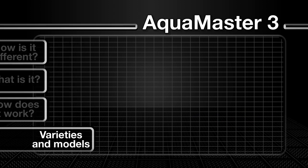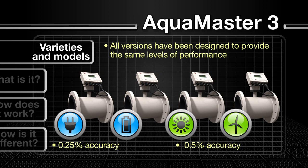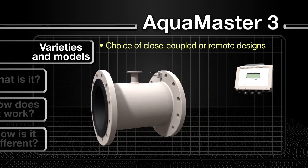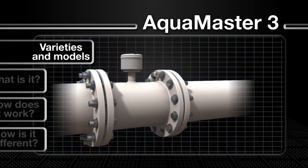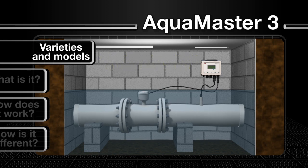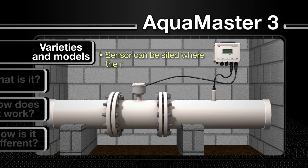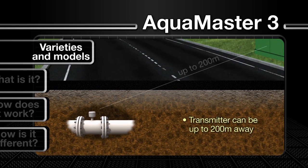The mains, battery, and renewable energy versions of the AquaMaster 3 have all been designed to provide the same levels of performance. The only variation is in accuracy, with the mains powered version offering 0.25% accuracy compared to 0.5% for the battery and renewable versions. Users also get the choice of either close-coupled or remote designs. The AquaMaster 3 can be buried, fully submerged, or mounted in an installation chamber whether dry or flooded. The transmitter can be installed with it or separately in a ground-level cabinet, with the sensor and transmitter up to 200 meters apart — ideal where the sensor is buried under a road or highway.